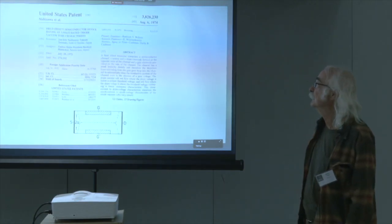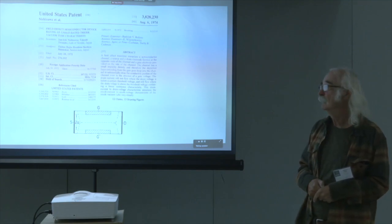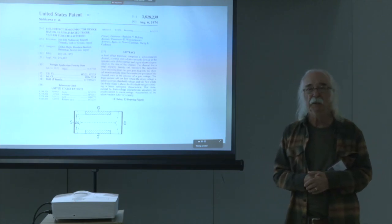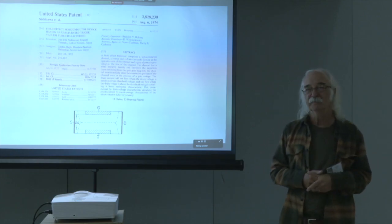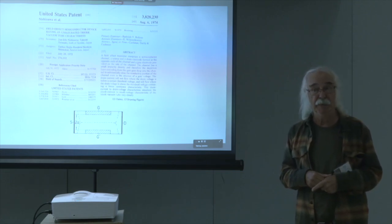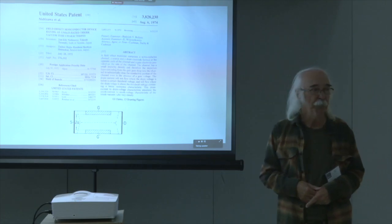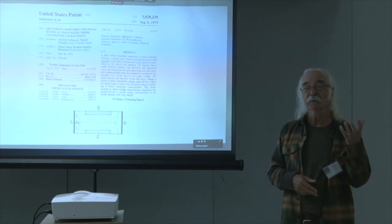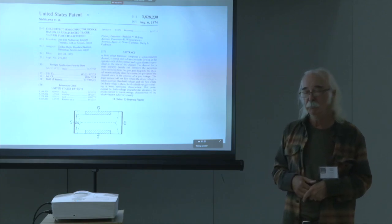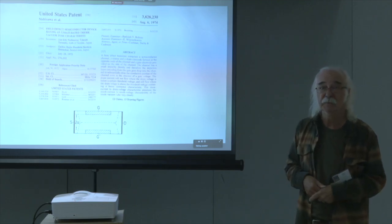Next, please. Now, there was another Japanese gentleman, and this is apropos of SITs, S-I-T, static induction transistors, which unfortunately are in extremely low supply after everybody scarfed up the remaining Sony VFETs, and after I scarfed up the remaining Tokin power SITs. You can still get a hold of them, and they're worth having, because it's like having a tube that can do, I don't know, 400 or 500 volts at 30 amps or more at 400 and 500 watt numbers. They even have 1 kilowatt parts that were made by Tokin. Unfortunately, Tokin was wiped out by the Fukushima earthquake, and it was not Panasonic. I think their parent company by then elected not to pursue that market because there's lots of other hot technologies that were beckoning.